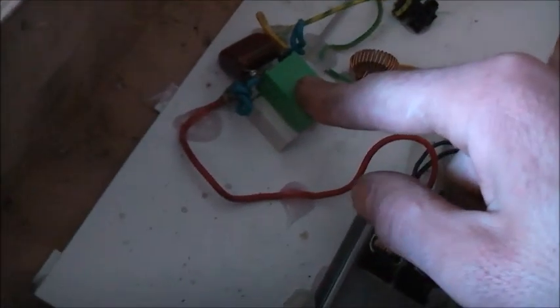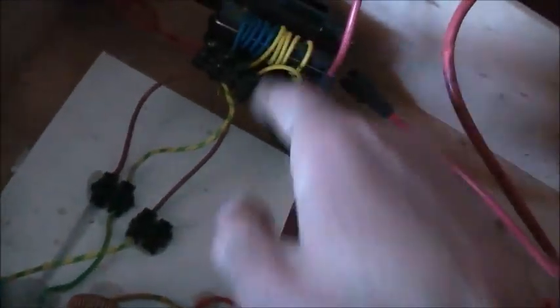Short-circuiting lithium batteries is a bad idea, so it's a good thing I took note of that. I thought the capacitor was actually going smoky, but it was actually the wires. I've got some high-temperature wire and some high-current wire from a degaussing coil. It's hard to work with once you strip this wire, but it can take a lot of current. The flyback doesn't even get hot now - that wire is perfect.